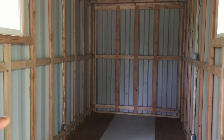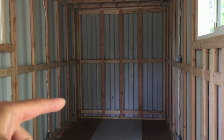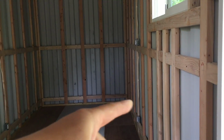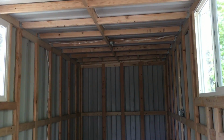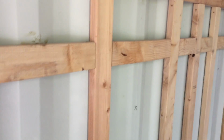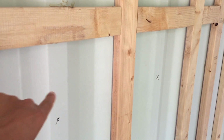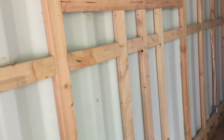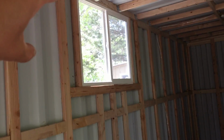So by laying the frame on its side horizontally, like a lot of the construction that I do, you capture that space in terms of the 2x4 width on this side and that side, as well as the rear. And of course, the top is just traditional framing. It's a little bit more than 16 inches, but that's really the shipping container. Because what I'm trying to do is go from peak, as you can see right over here, this one is a peak, so I want to go every other corrugation at least. And then in the window areas, there's a little bit more just for structural support, not that it really needs it.